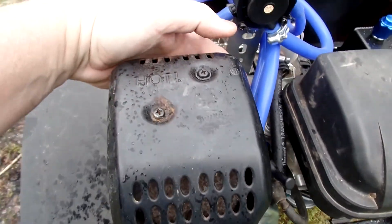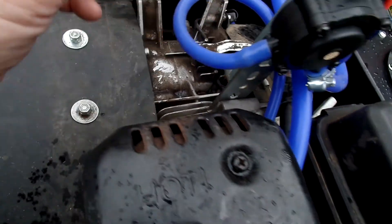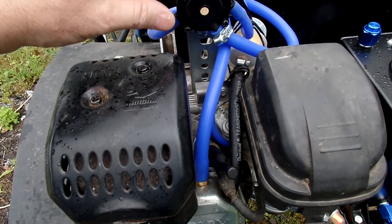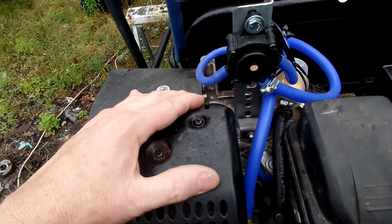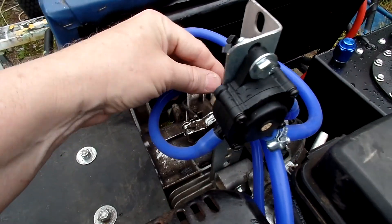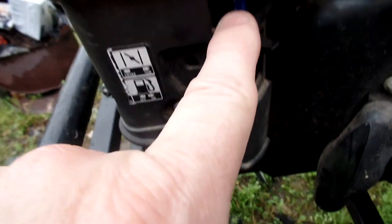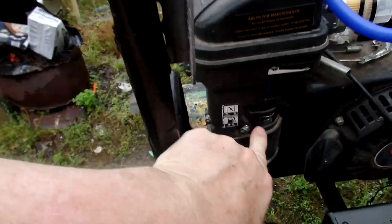I connected the pump mount right where my finger is — the original bolt is an 8mm head and that's a 10mm bolt. I buffed it down so there are no sharp edges and I mounted it high above the engine, because with my first mount I put it down low and all the hoses were kinking. You can't have kinked hose in a fuel system. The line goes to the motor, comes around, ties off, goes through the original location so I can still use my on/off switch.